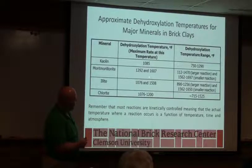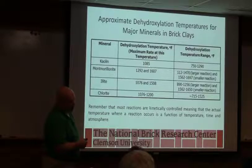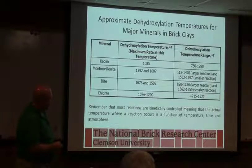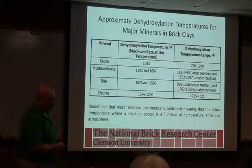Okay, so this is later in the preheat. You may have an area where you slow down versus with a kaolin, just depending on how difficult the body was to fire and how tight it was. But this material is going to hit its soak temperature at a lower temperature than this. Remember, we said the montmorillonites typically fire at a lower temperature.